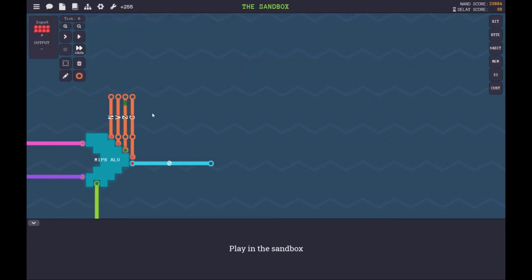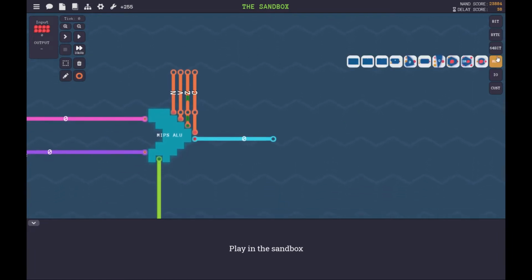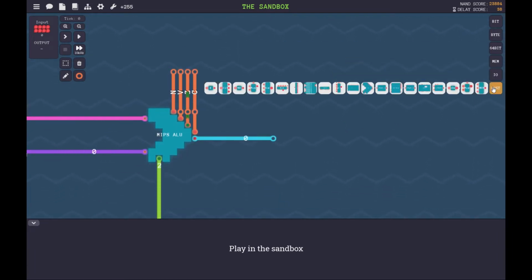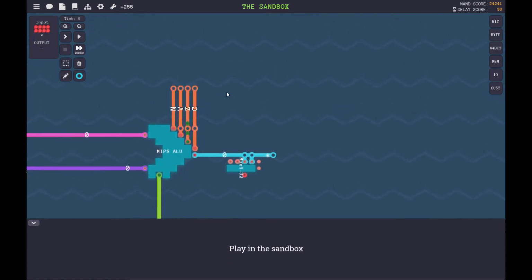And we will need these in order to do the set less than thing. So you can see in the diagram, which, by the way, I recommend you keep open on the side somewhere, because I'm not going to keep tabbing out to it. We can see on the diagram that normally for set less than, we just need to choose between the result of the ALU and the value of the carry flag. But it turns out that that's actually not good enough for our purposes, because we also want to support unsigned less than, right? We want to support both. So actually what we want to do...